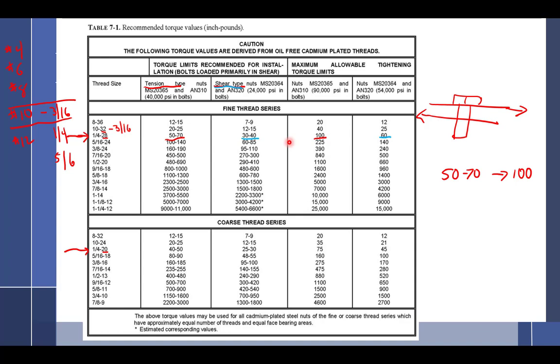You ever do turn of the nut? Did I ever do turn of the nut? Well, I have, definitely. Turn of the bolt, turn of the nut. So it's the same concept. An engineer has figured out that if you tighten a bolt up to a certain point, and then you turn it X number of degrees, that's the same thing as a stretch. And it takes out the error of improper torquing, too much oil, not enough oil, things like that.